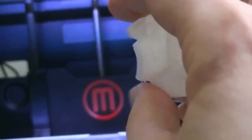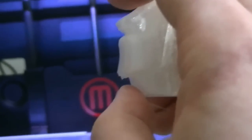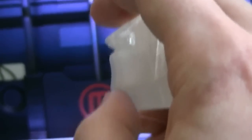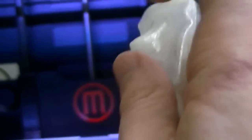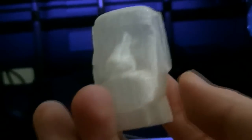This point here lacks something, and that's why the printer has some difficulties making something very accurate here, especially on this point. Every other point of the other layers does not encounter that kind of problem because there is something underlying that you can use to build on. So the ideal objects are objects that have a strong and solid base and enough space on the underlying layers to build something on top of it.